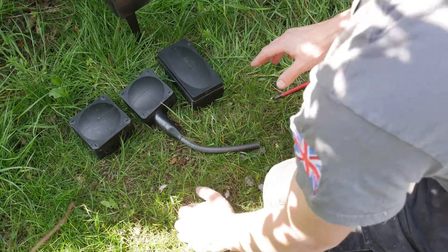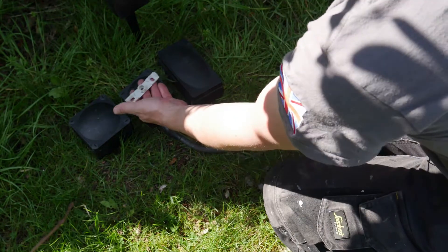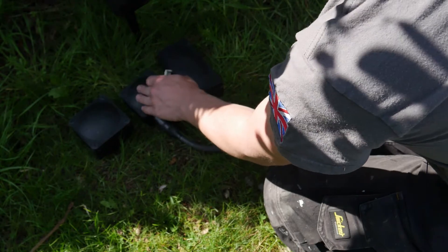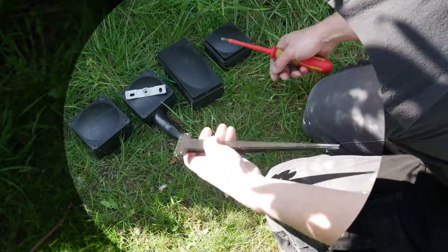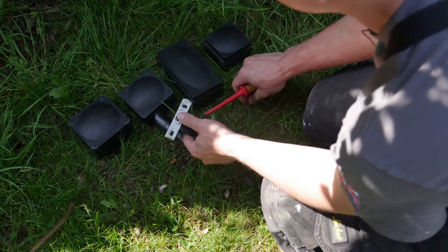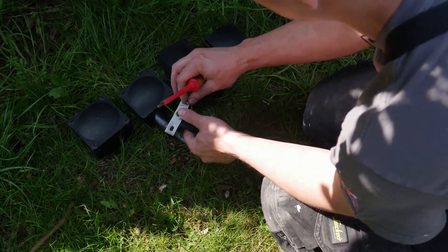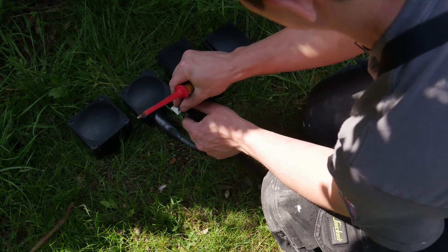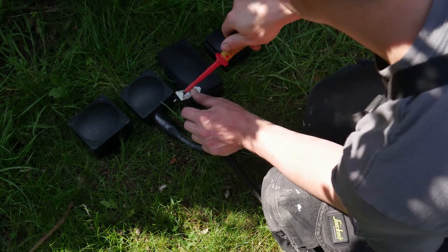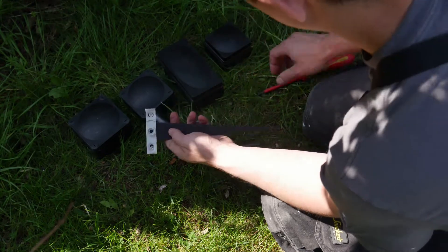Now for using the 308 and 407, what you need is the little grey bracket — don't throw those away, because that grey bracket comes with the 308 box and it comes with the 407. What you're going to do with the grey bracket is line it up on the back of the spike, then take the two screws that come with the spike and screw those through the holes on the bracket, and that will line up perfectly.